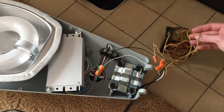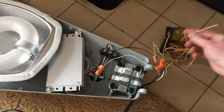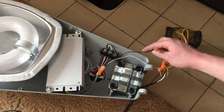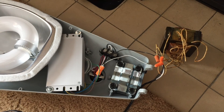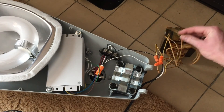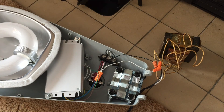This is your 240 input for this ballast. So you're hooking up to the 240 input line — that's what we did here. We hooked up the line input for the fixture we wanted to light up to the input line on the ballast for 277. It's very interesting that way. Same thing for 208: if you have a fixture that is only for 208, use the 208 line. So it's kind of like a really interesting step-up transformer. Overall, I really hope you enjoyed — please comment, rate, and subscribe. Thank you very much for watching.